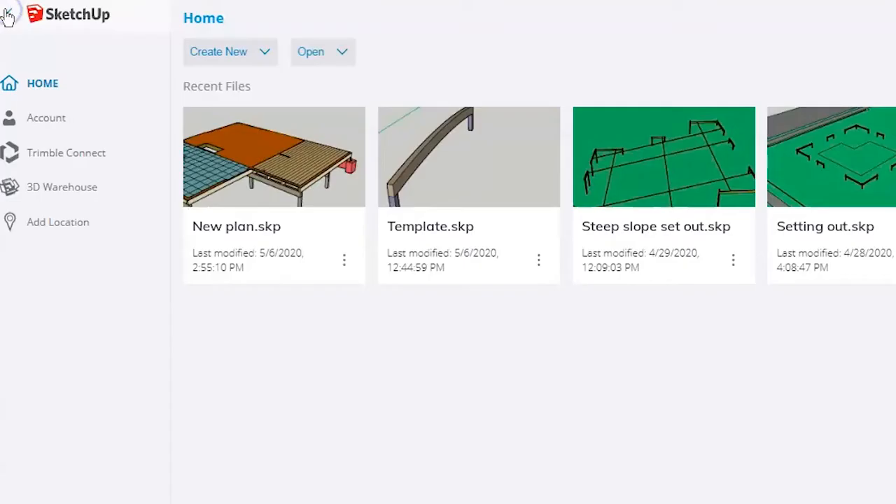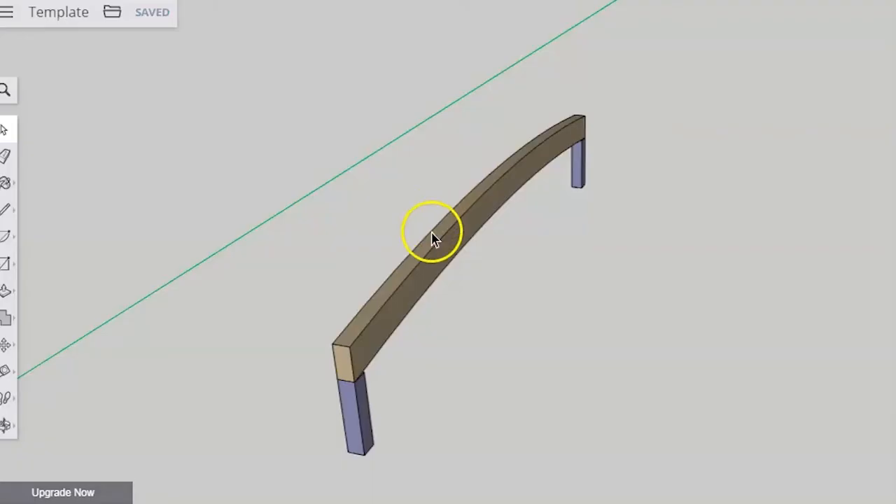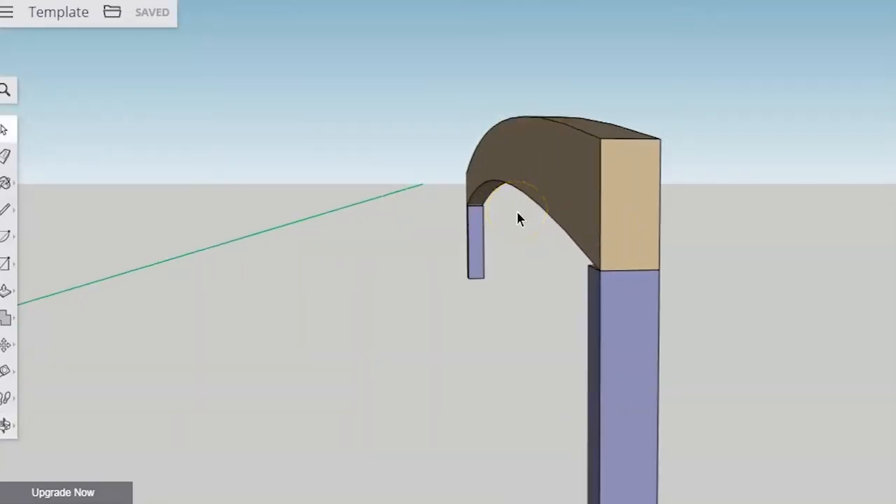When we pick up a piece of timber, very often it is not a straight piece of timber — quite often they have slight bends in them. When you look at a bearer you can see there is a bend or bow in it, and it is important that that bow is always facing upwards. That way, when the load from the floor or possibly the roof framing comes down onto it, it encourages the bearer to push down and become straighter. If the bow is down, then the bow is only going to get worse under load.